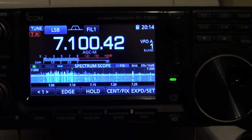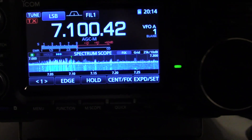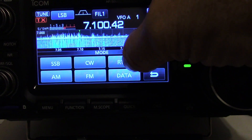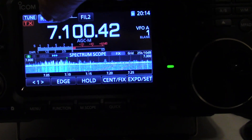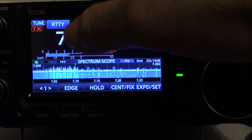You're seeing all this radio teletype in here — it's amazing. So you'd like to copy it. You can hit this lower sideband up here and go to RTTY. If you want to go reverse, you just hit it again and it shows reverse, but I'm not going to go reverse. You want to go just regular radio teletype.